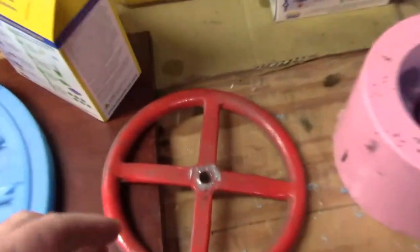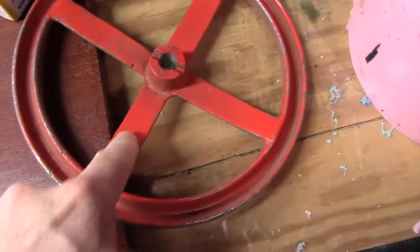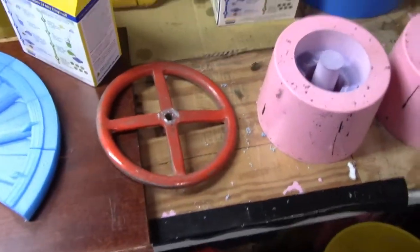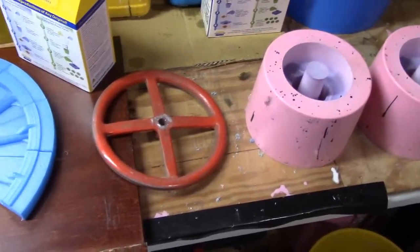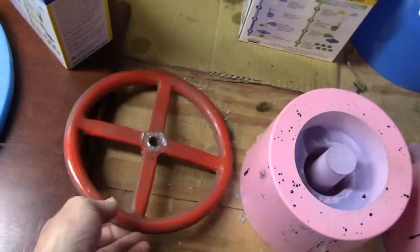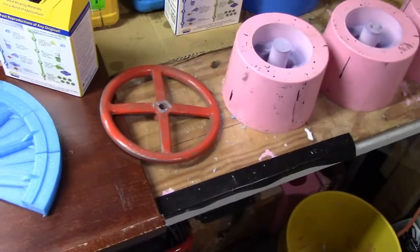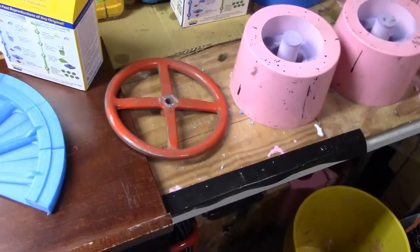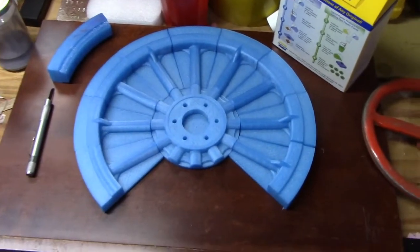At the same time, I'll be doing a steering wheel. People have been asking because they end up cracking right here — the main reason is they don't have a back gusset. So I'm redesigning this 8-inch wheel, which is the vintage style that came off a vintage go-kart. People want to keep their go-karts similar to what vintage was, so we can supply them with a wheel that has proper gusseting and won't break.